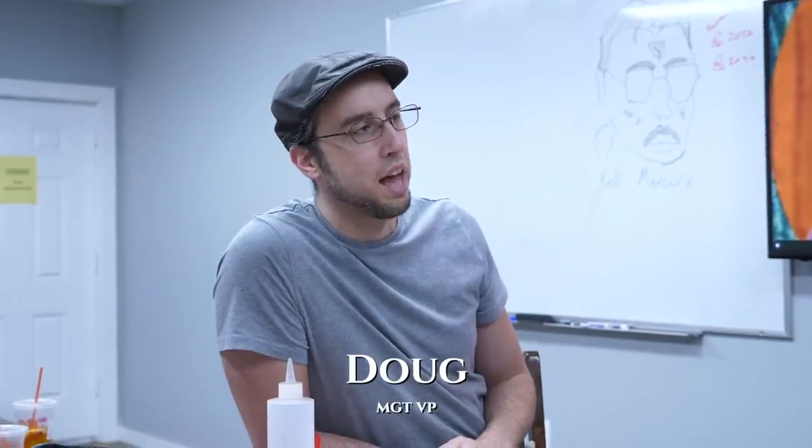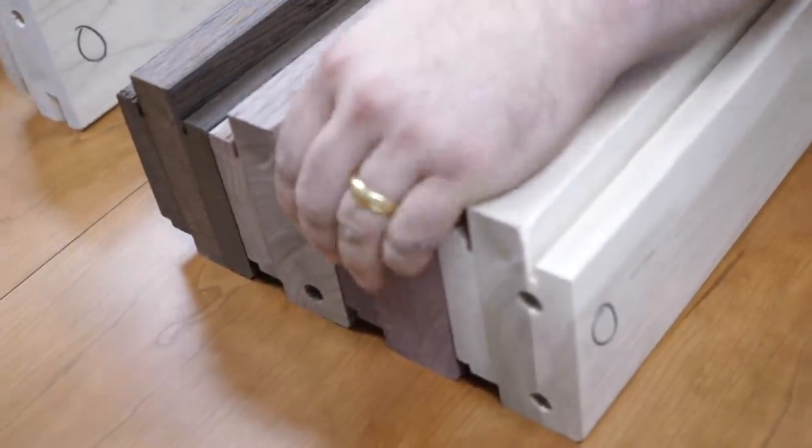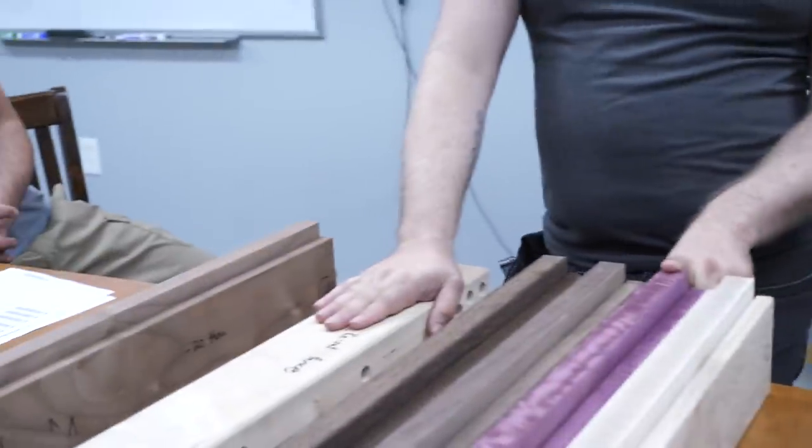What is the result of that test? I cut 4. They are within 1 or 2 thousandths of each other. Ding, ding, ding. Indiscernible. As close as you can ever get in woodworking. Okay, that is actually very good. Shooting board accuracy. Then I ended that program, unclamped the fence, sent it to 8 feet, sent it back to the same exact dimension, ran the same test the same way. 2,000ths off. So the fence seems to be repeatable even when it moves and comes back.